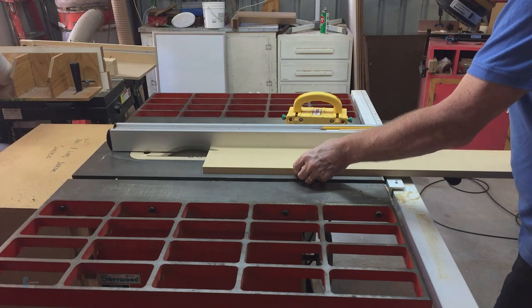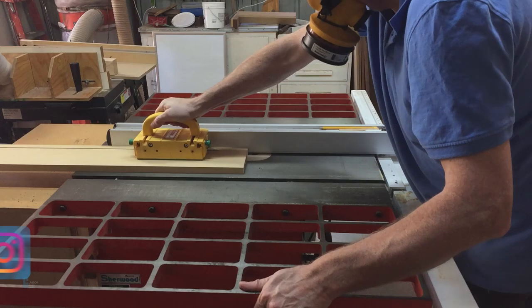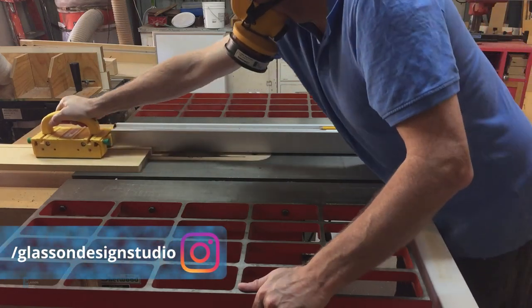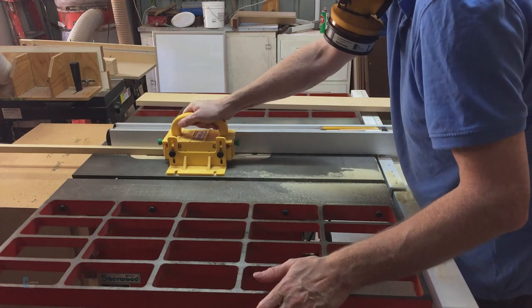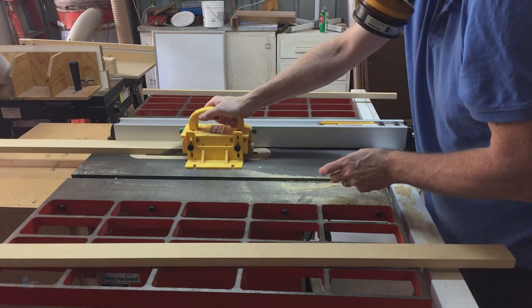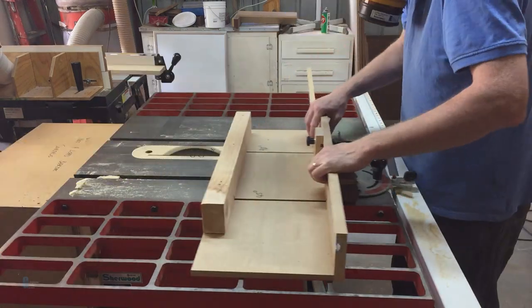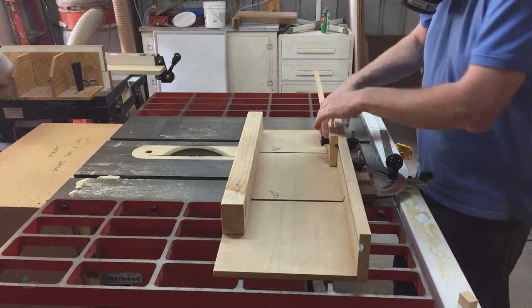Let's look at how I built it. The jig is made from 16mm MDF, and this is a router with a guide bushing for the mortises. I cut a strip of MDF the same width of the bushing to guide the router's path. I cut the strip over width then refined it using the table saw and the digital calipers.